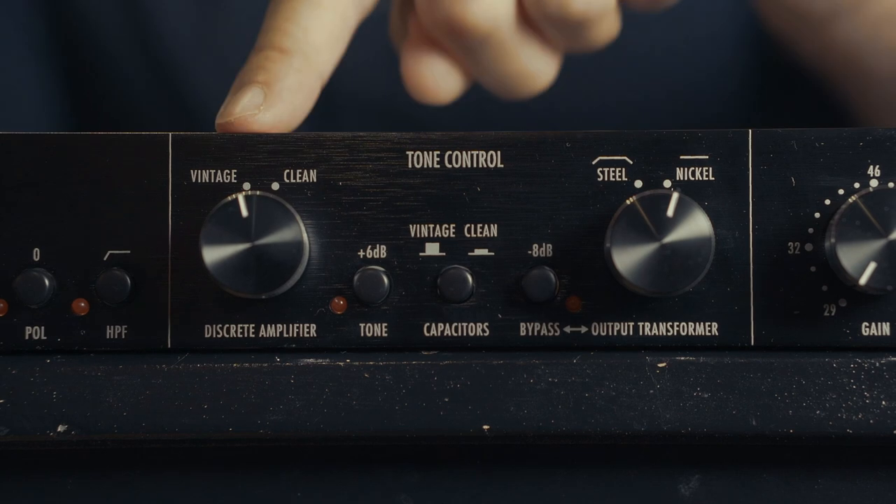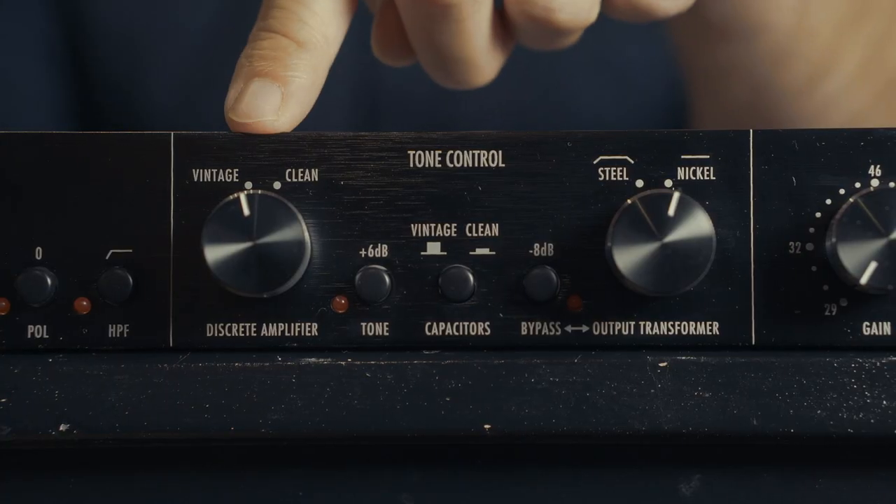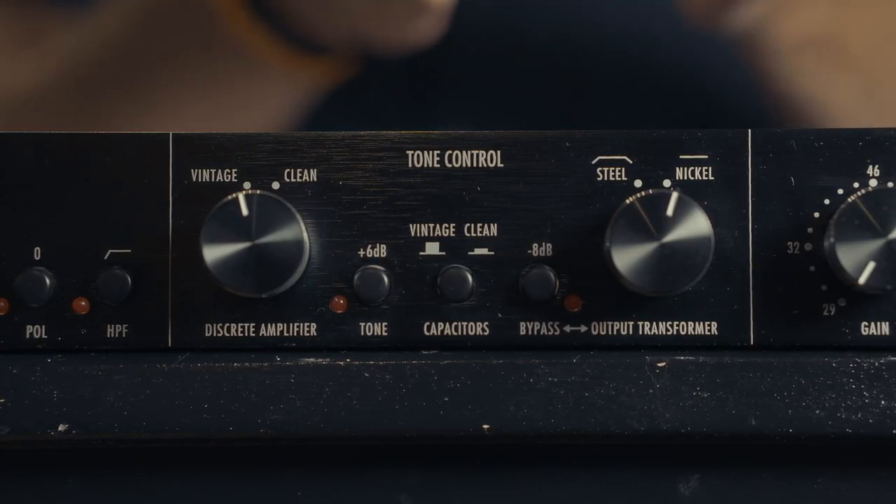If we switch this knob to vintage, we're going to hit the 1731 Melcore — that's basically the predecessor to API. This is also a very analog sounding circuit, probably the more colorful of the two with more mojo or more vintage vibe. You're going to hear the most difference between these op amps when you're really driving the input of the circuit, because how they break up is really where the character comes out. Lastly, we have the standard six-pin 2520 pinout, so tech heads can throw different op amps in here — something like the John Hardy 990C, which is considered extremely clean, or any variety of directions.